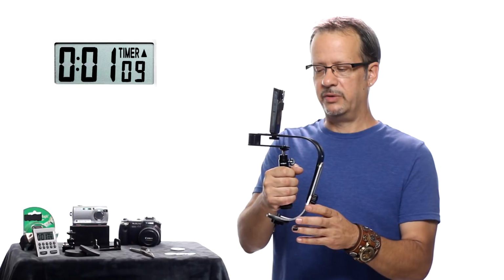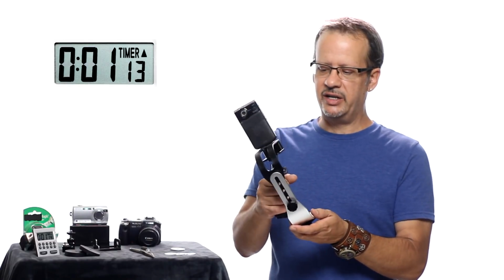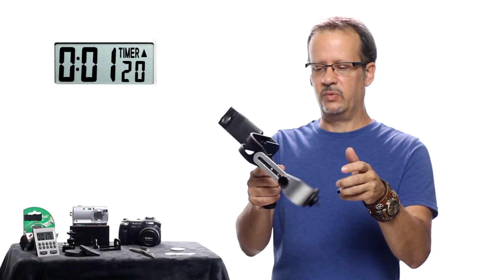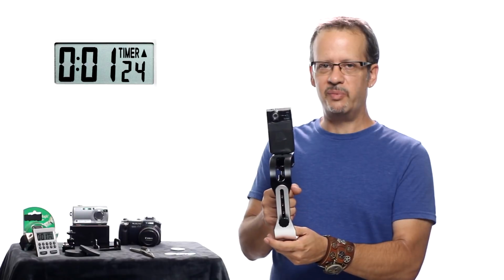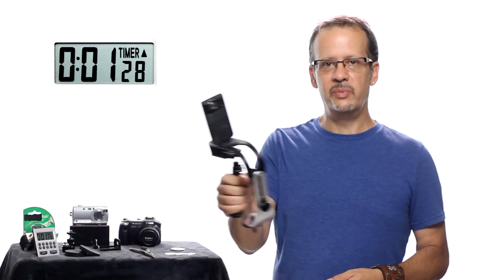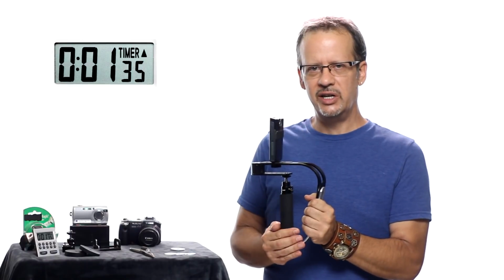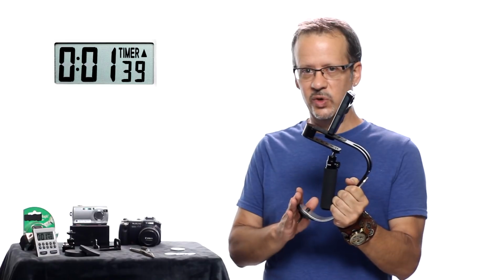Okay, I was pretty lucky. It's level front to back, side to side. Let's see what that drop time looks like now. That's just over a second. Not even a second. And if you remember, we want a 2-second drop time, because if we don't, what's going to happen? Yep, that bottom arm is going to start to swing and sway. That is not good. So since the arm is as short as it can go, and I've got the lightest weight on, I've got nowhere else to go with this weight.